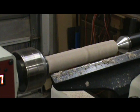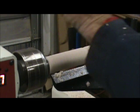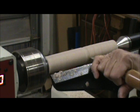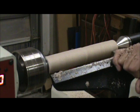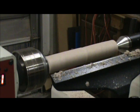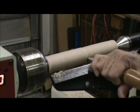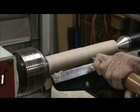I've got it rounded. I'm going to be smoothing it down to 1 3/8 inches just using a pair of calipers. I've got my gauge ring cut here at the end so I'll know exactly where to go. I like to turn at as high a speed setting as possible — it's just a matter of a gentle touch and keep the tool moving. You can always take off more; you can't put it back on. Everything I make is one-of-a-kind.